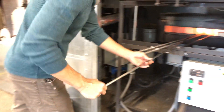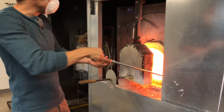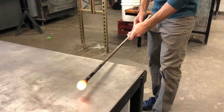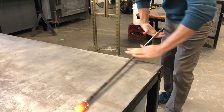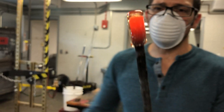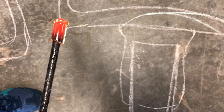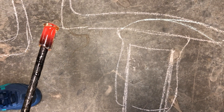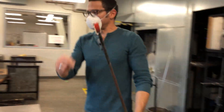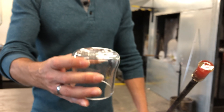Got my punty rod. Even if I get a small amount of glass on the tip, there are two ways of making this problematic punty. The first is people push forward and pull back — push forward and then pull back. Now I have this big blob on the tip and it does not have that curve. So if I press this on, it mushrooms out. This is touching too big — there is no little curve to start to break. It's going to take a big chunk out of the bottom. Too much glass off the tip mushrooms on when you smash it.